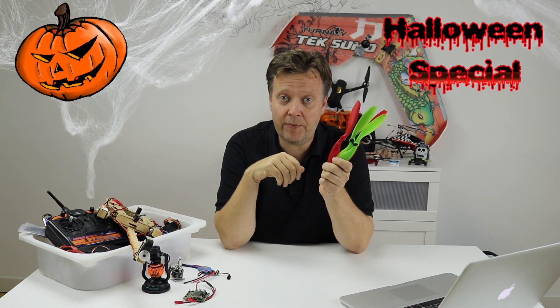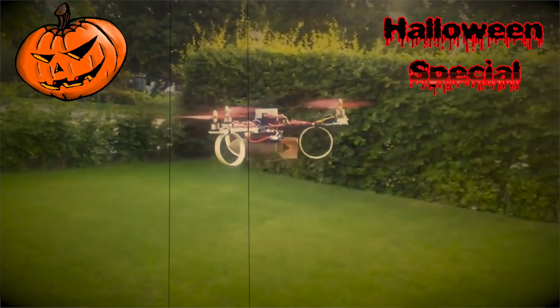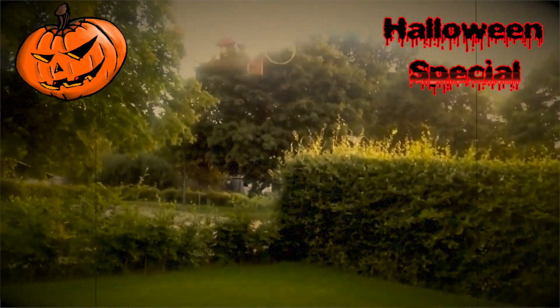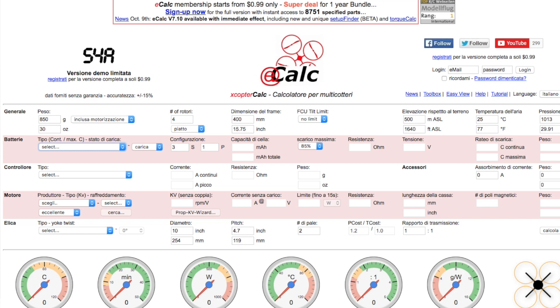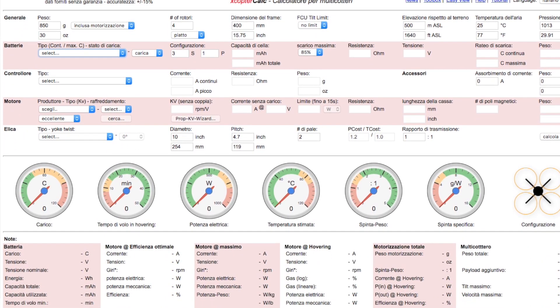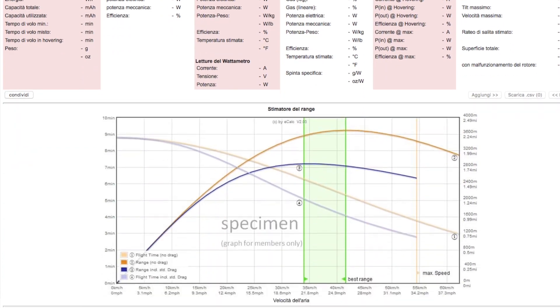Without propellers there would be no flying pumpkin. We plan to start out with 8-inch propellers with a 4.5-inch pitch of the blade. Much can be said about selecting the right props for a given setup, but I've built a setup before where this combination has turned out quite successfully. There's a tool online that will allow you to calculate the thrust for a given motor and prop combination if you want to go all technical — link in the description below.